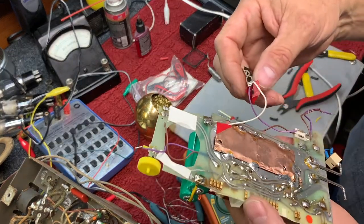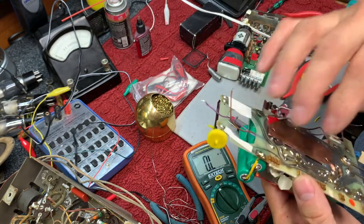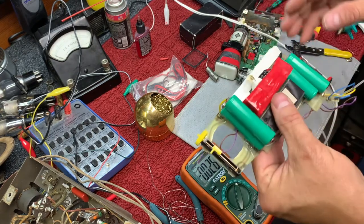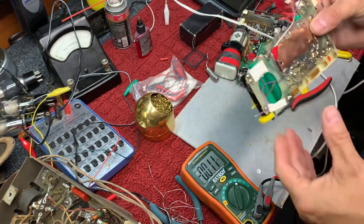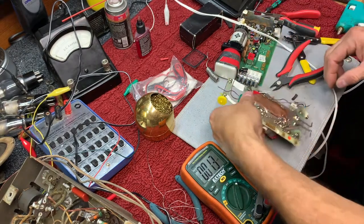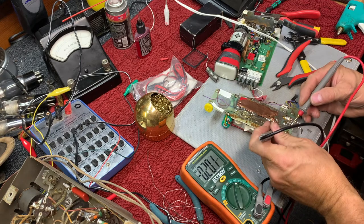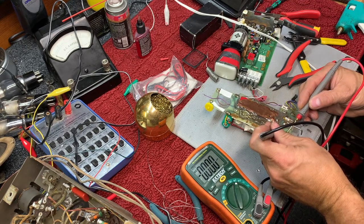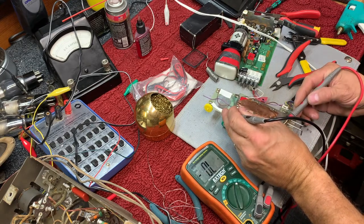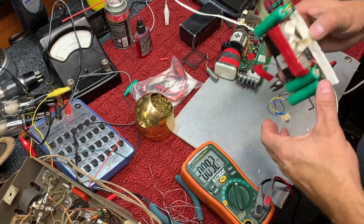Let's double-check this link — zero volts here. Good, so the fusible link is still good. Let's put this tuner back on and reassemble. All this stuff can create a short on the board, so we've got to be cognizant of that. I'm going to put the audio in first. This connector needs to be put in like that, where the leads are coming out parallel to the chassis — otherwise things bind up when we put it all together.